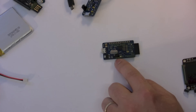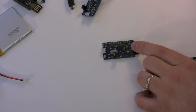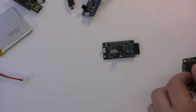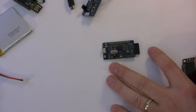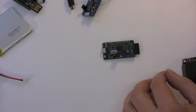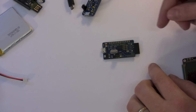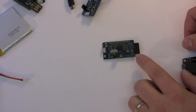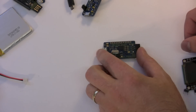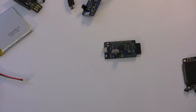We've also got a voltage selection jumper on here. We've got an ICSP header and we've broken out all of the additional pins on the 16U2. So even though we are going to supply this preloaded with firmware specifically for USB to serial conversion, it's really just a general purpose 16U2 breakout board. You could load your own firmware on this and use these IO pins — you can basically use this like a micro-sized Arduino. The voltage selection allows you to use it with multiple types of Arduino board.